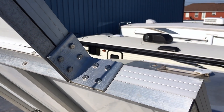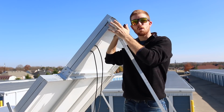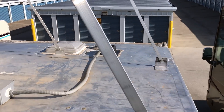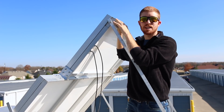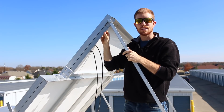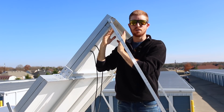You'll notice I also have aluminum brackets here to hold up the solar panels. I've got it bracketed in two different areas so that if there's a lot of wind, there's not going to be a lot of torquing and wobbling with the solar array — it is a lot of surface area for wind to catch. I did the measurements to make sure it's tilted at exactly 50 degrees.